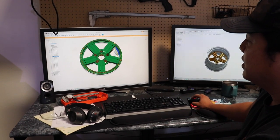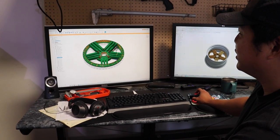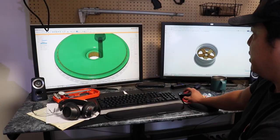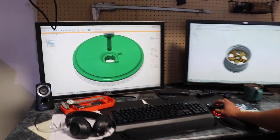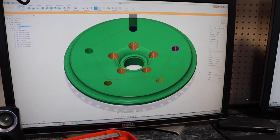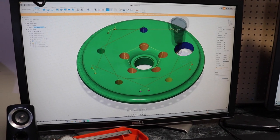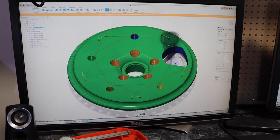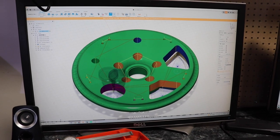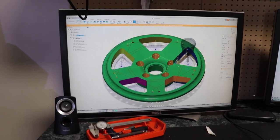You just see a face, choose what wheels you want and what color — that's the easiest part of the job. These guys have the hard part. Every feature takes multiple passes to get it right. I'm running a simulation for you — so this is like what the machine would do. It runs a simulation just to make sure everything's good, and I have all my tools drawn up to make sure it doesn't crash. This is exactly what the machine is going to do. Look at that — so those are the windows and details getting cut out.